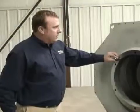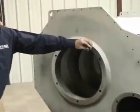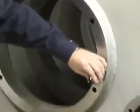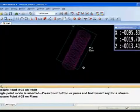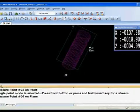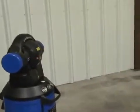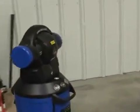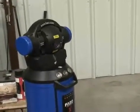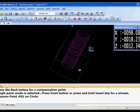What's been done now is we've moved the tracker to a different location to pick up this center bore. By doing a simple leapfrog function, we were able to move the tracker from one position to the other, and now we can see the main bore. By taking these dimensions we'll establish the centerlines of each one of these bearing locations, and compare them to determine concentricity and to establish a cylinder through the center points to determine perpendicularity with the fluid ends.